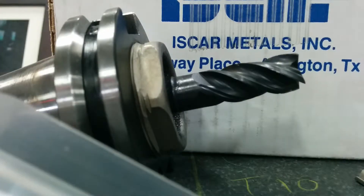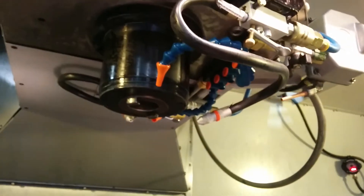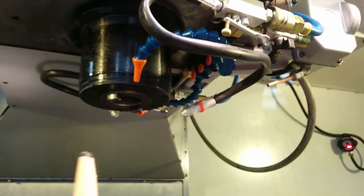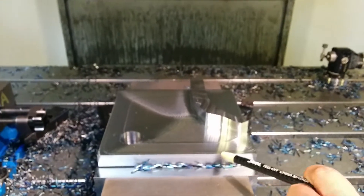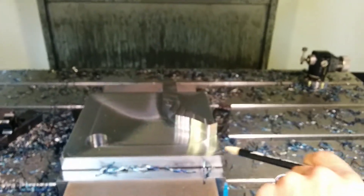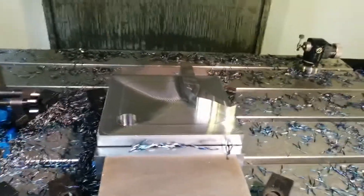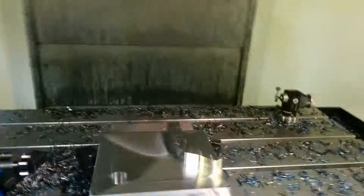She did well. A few extra things I added to it: I had to add another airline — you can see I got one here in front, one right there, and one in the back. So that way when it's going around the block it always has air going in one direction, hitting it on this side and this side, and then the other one hits it on this side in the back. You definitely have to put a lot of air into it, and it does not like coolant — I can't stress that enough.